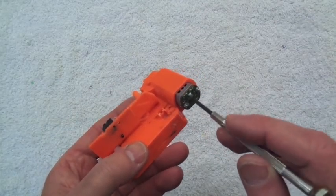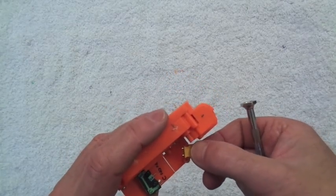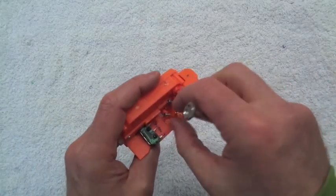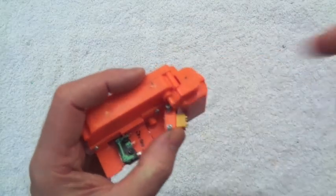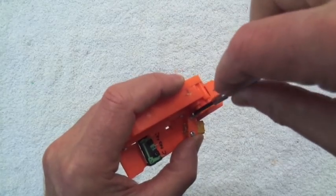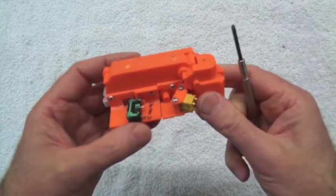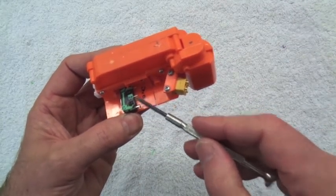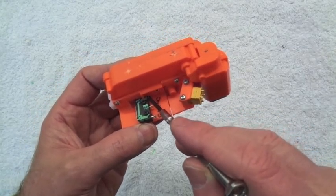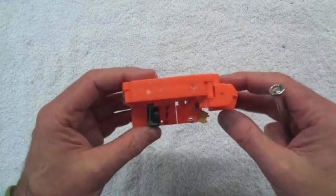The positive and negative from the motor will pass up through here, held down by the appropriately named Hold Down. That positive and negative will attach to one of those XT30s, and the other one will take the common and normally open from the switch. The normally closed, if I remember correctly, has another negative going up to it to the XT30 connector.